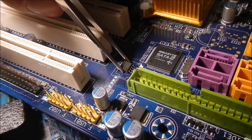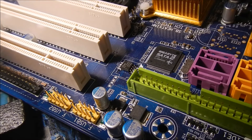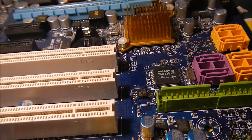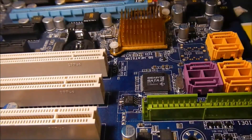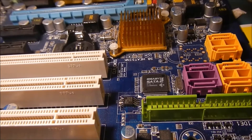My motherboard has no battery in it at the moment. The next step is to position the new BIOS chip and then do your best. Make sure that each pin lines up properly. I need to use the block, then put the other pin on top and use the iron to solder the chip down to the mainboard.